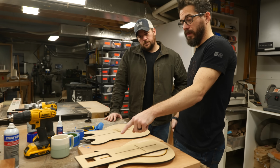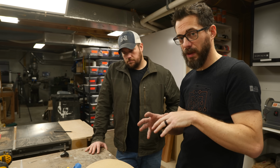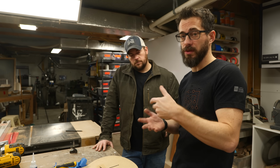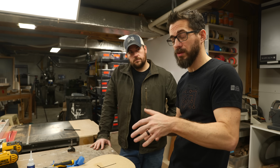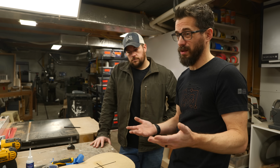Yeah. I actually found a website last night, and I'll put a link to it in the description, but it had vector templates for everything about the Stratocaster. The outline, the pockets, all of the electronics pockets and measurements. So if you just want to use the measurements to make your own, you can, or you can use those vectors to cut out templates to make your own Strat. They had a bunch of different guitars as well.